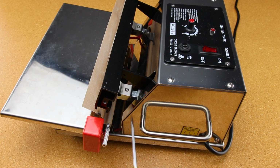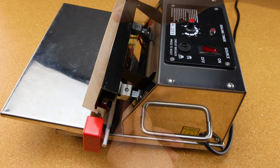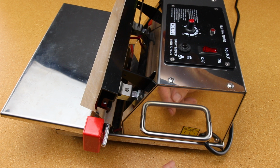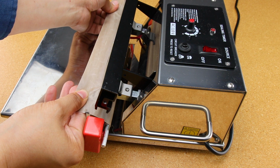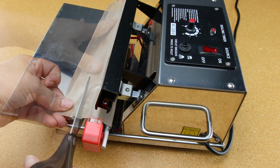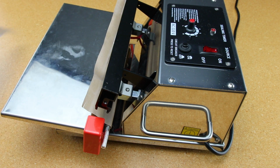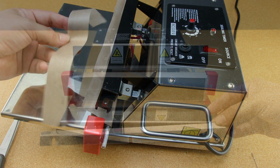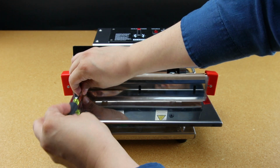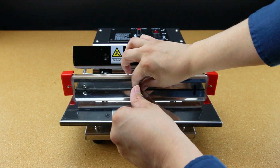If you wish to replace the old insulator material on the bottom bar, you will need to loosen 2 screws located behind the bottom bar. Then, carefully roll out the insulator material. Trim the leftover material, ensuring it only covers where the screws will hold it down, so it doesn't obstruct the faceplate from being screwed in. Finally, reattach the faceplate, and we're ready to move on to the top bar.